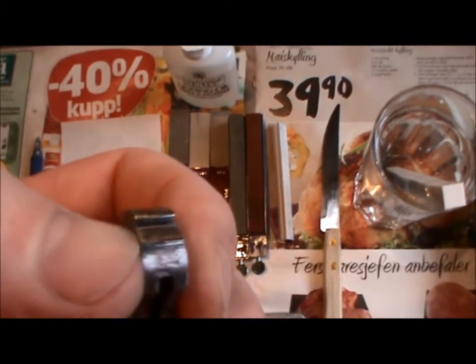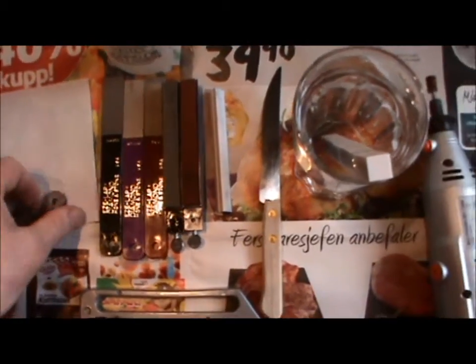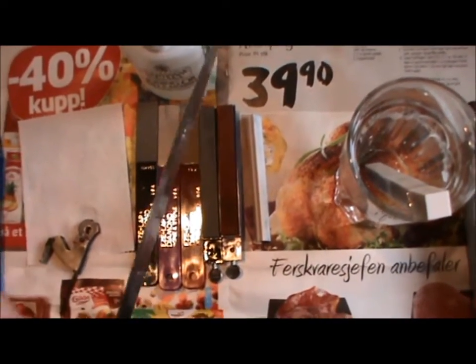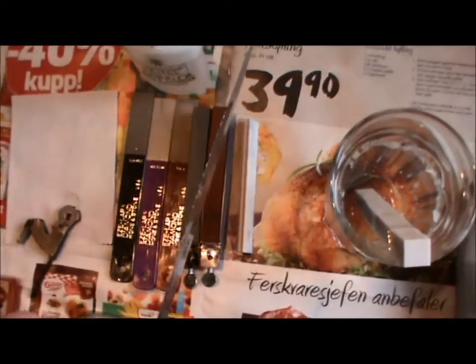Started with a grinder, some diamond files, some stones, honing, and it came out like this. Even in the groove here, I took a knife with some emery paper on it and worked it back and forth in the slot - in the half cock slot.